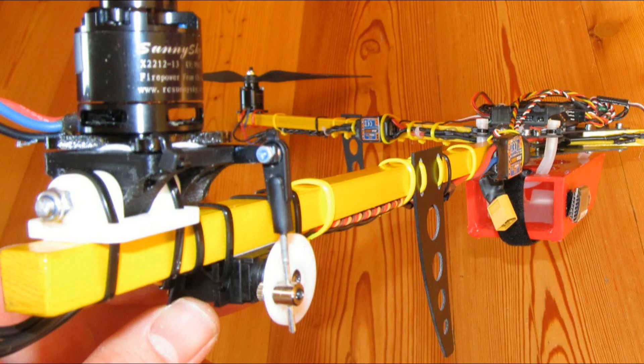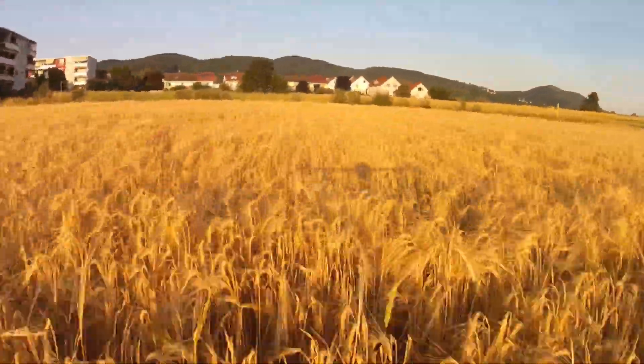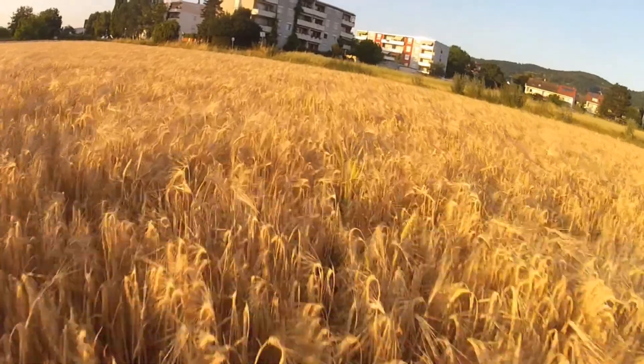The rear mechanics have a simple and classic layout. I did not like the idea of the servo being mounted directly to the axis — there was no way to protect the gears from hard impacts in a crash. So I chose to connect the servo with a ball connector that is mounted with a 2mm nylon screw. The idea is the screw will tear apart and protect the servo in case of a crash. I had some doubts it would last during normal use, but I flew this way for nearly one year and even in lighter incidents the connection did not break apart. So I kept this as a good idea.